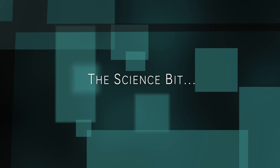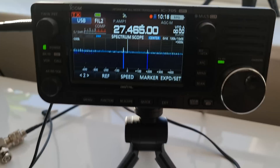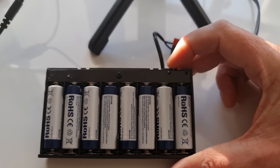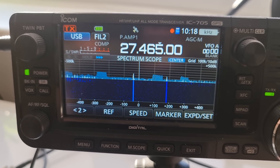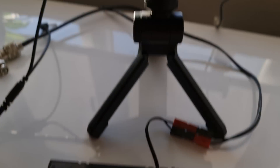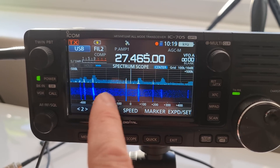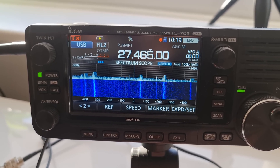I'm wondering if there's something inside these batteries that's interfering with the radio. It's the next day now and I've been looking into this problem more — are you ready for some science? I've got eight of these X-Star batteries in a battery holder giving me 12 volts out, and I'm going to power a radio off of it. The radio is set to the same band as the RC car. Watch what happens when I turn this bank on — look at all this interference. The interference is coming from these batteries, and the more I ground myself to it the more interference it creates.